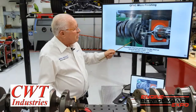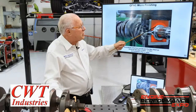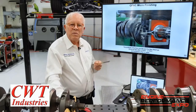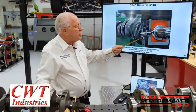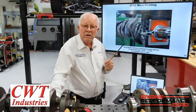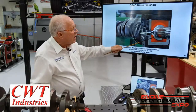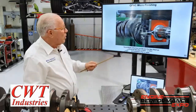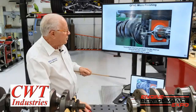This is a QPAC microfinishing machine using 15-micron paper. The cutouts are supposed to polish the radius, but it doesn't do a real good job — the point is I don't want circumferential marks on it. This is really the first process: doing the rods and mains with the QPAC machine and 15-micron tape, getting to 2 micro or better. The trick is this shoe is 100% cylindrical, sized to the main or rod, so you don't get bumps or hoops. We're looking for flatness within 0 to 2 tenths.